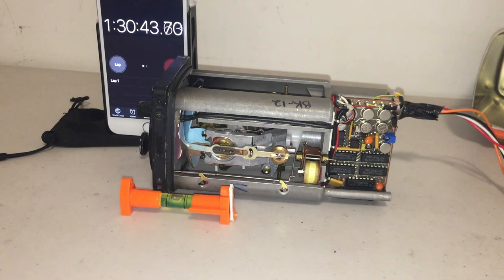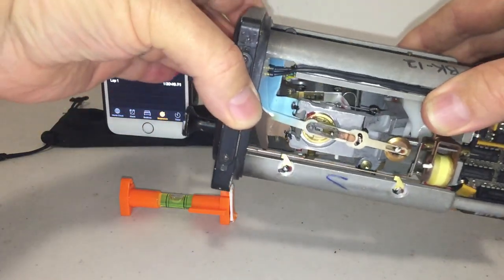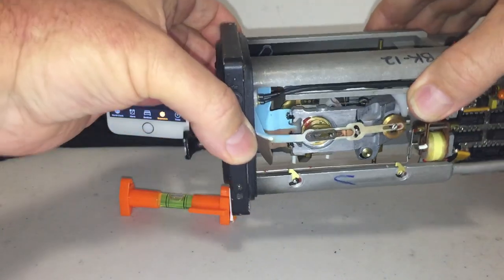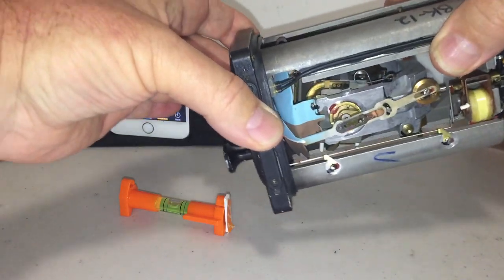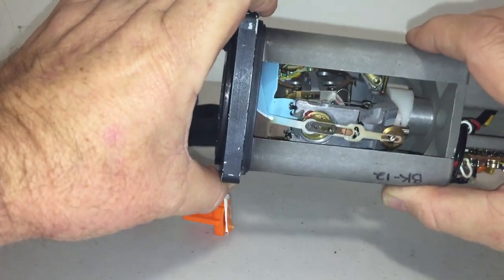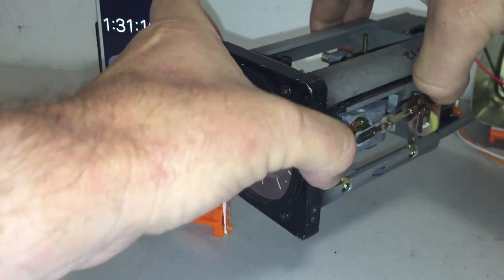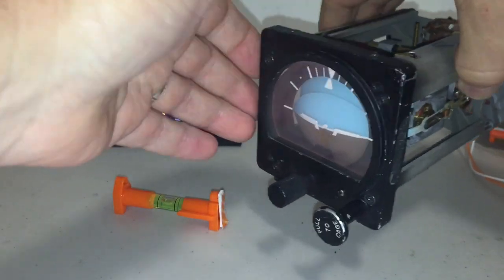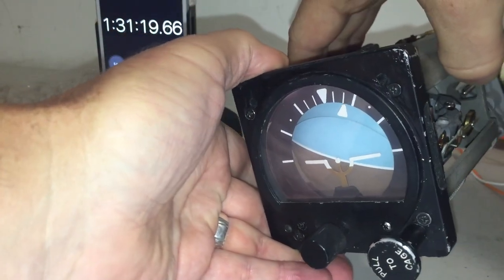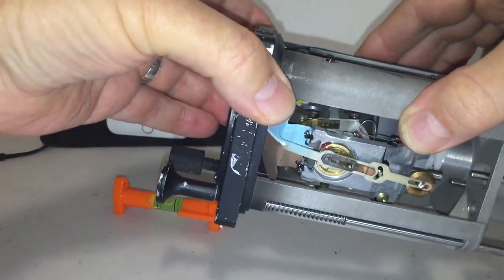The time-lapse has just finished, so I'll just maneuver the gyro a little bit so you can see how the internal part remains level. No matter what I do to the external case, the internal gyro is remaining level. And obviously that translates to an attitude indication on the display — pitching down, pitching up, rolling left, rolling right. The gyro inside always stays level.